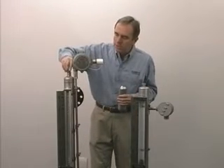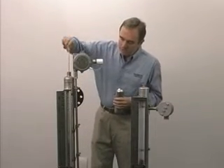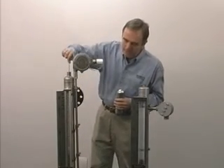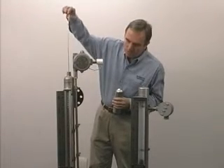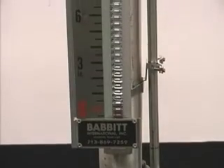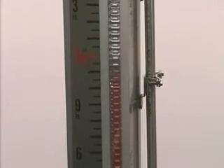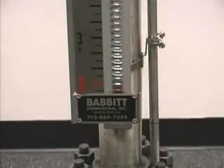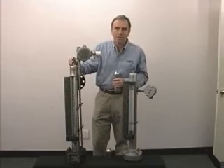Our other indication option is a flipper roller. These are the best flippers in the business. They can take very high temperatures, and they change from silver to red as the fluid level rises. They've been tested up to 800 feet per minute on rising or falling levels, and they're absolutely bulletproof. The flipper is made of aluminum, rides on a stainless steel bearing surface, and there's a permanent ceramic magnet inside each flipper.